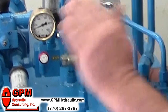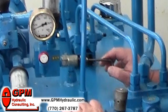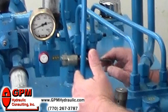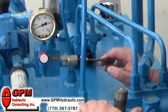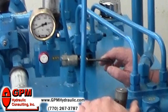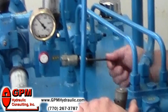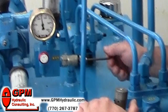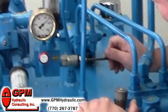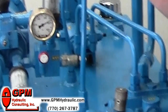You always set your highest pressures first, then work your way down to the lowest. For this particular pump, we're going to assume our load is 300 psi, so that means the compensator will be set at 500 — that's 200 above. So the relief valve will have to be set at 750. Now we adjust the relief valve clockwise and you can see the gauge increasing. We should be able to reach our total setting of 750. Once we get to 750, you can see that on the gauge and we can also hear it dumping.